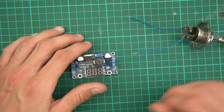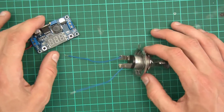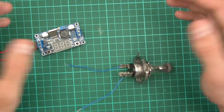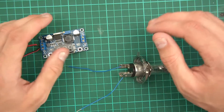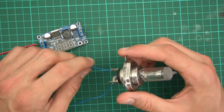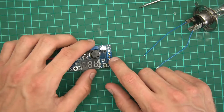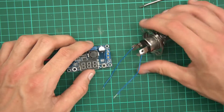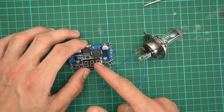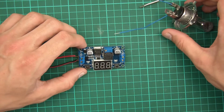Can it deal with 3 amps? Not at all. I tried the resistor — it was a bit of a rough calculation. I used an 8-ohm resistor and it couldn't handle it. I did have 24 volts, which with 8 ohms should be around about 3 amps. Then I tried this automotive bulb — a 12-volt thing that draws 3 amps. I put that on here with 31 volts in, 12 volts out, attached this, and it should have drawn 3 amps but it couldn't. The voltage dropped dramatically to 3 volts and the thing just couldn't light. So can it deal with 3 amps? No.